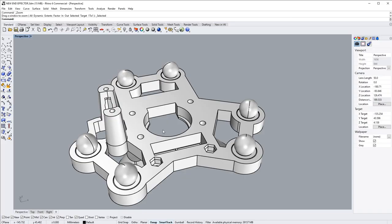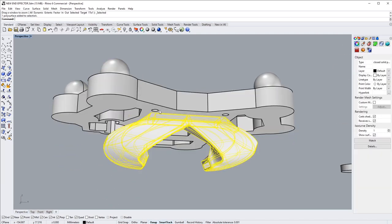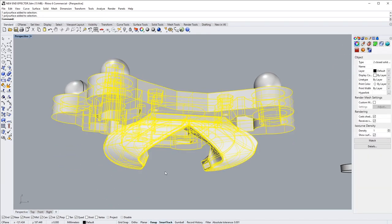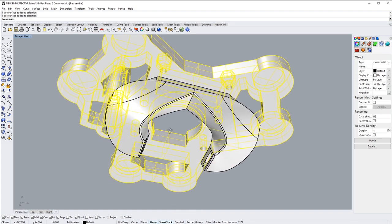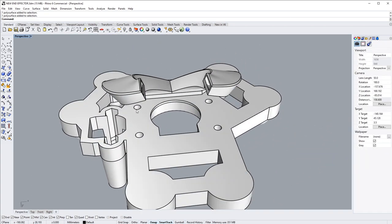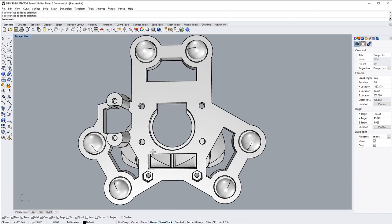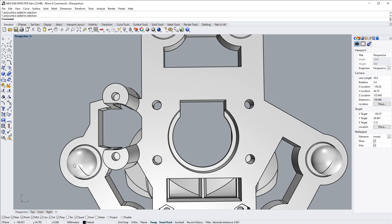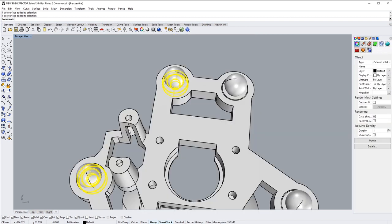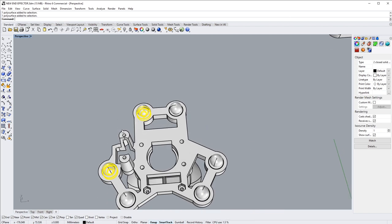This CAD drawing here is the end effector, obviously, and you can see what I was up to. I was trying to integrate the split cooling duct onto the effector so that it was a single print, but unfortunately this blocked a couple of the bolt heads, so you couldn't access those bolts. And as we found out, the BL touch is mounted too close to this magnet right here. I need to move this BL touch hole cutout so that it's exactly halfway between these two magnets, and hopefully we won't get that magnetic interference.